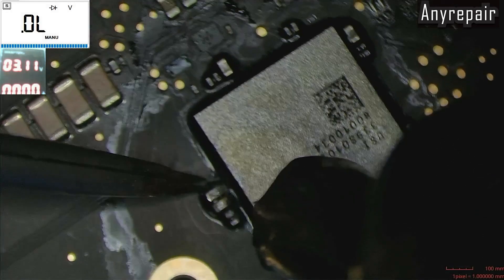Let's go at triple speed — put the board back, plug what we must plug to check what is going on. The amp meter is good. We have an Apple logo and a macOS loading bar. These are good news because the NAND flash is working and we are loading macOS. The case is okay — the trouble is no more. We have no short. We have a healthy MacBook.